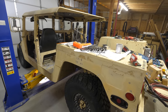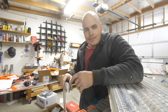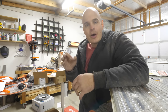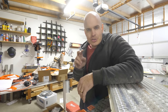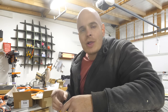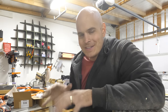When someone says they have a 12 volt car battery, it's not actually 12 volts the entire time. It ranges from 13 down to 11, and that voltage range between 13 and 11 tells you how much the battery is depleted. These lithium batteries operate in the same way. Fully charged at 100%, they are 25.2 volts, and fully discharged, they're around 18 or 19. So if we do the math, when all of these are wired together, we will have 453 volts when fully charged, and 324 volts when fully discharged.